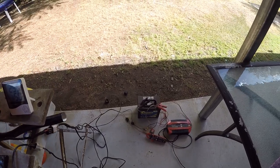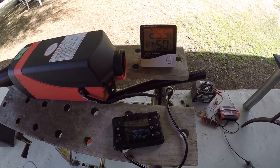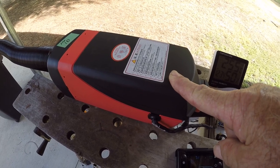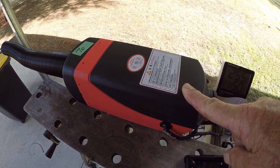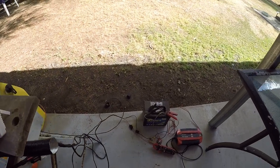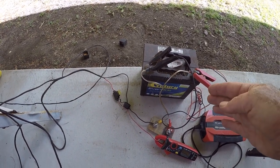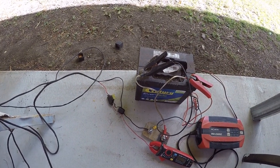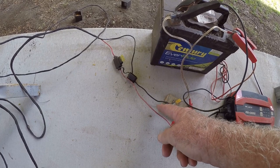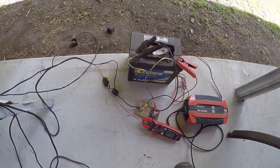It's very important that the master switch can't be accidentally turned off — for example, mistaken for a light switch. If you turn the master switch off while the heater is running, it won't be able to complete its cool-down cycle and you can get a serious overheat problem. It won't catch fire, but you'll destroy the electronic control unit inside the heater. Also, run the heater wires directly from the battery — not through a distribution box — and greatly increase the wire size, as this is the very minimum to handle 10 amps during startup, especially if you're extending the wire.